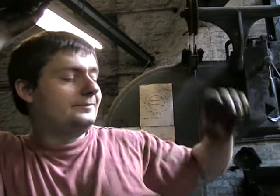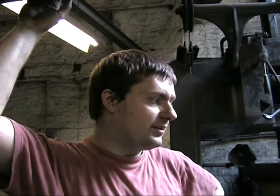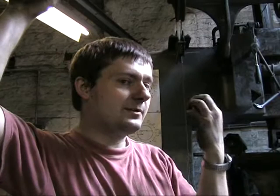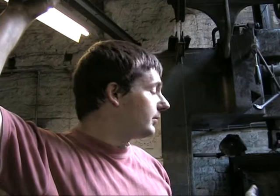This is the partial tones. Yes, yeah. If the partial tones are wild, then the bell will probably sound pretty disgusting. Whereas if the second partial is in line, for instance, then it will give the bell a much better pitch definition. Because if the second partial was a long way out, you'd hear the bell and think, well, I'm not quite sure what note it is because it just sounds so horrible.